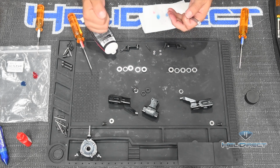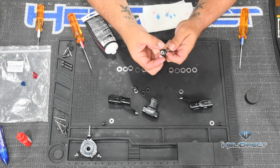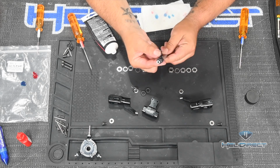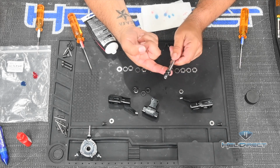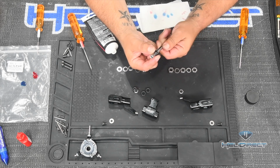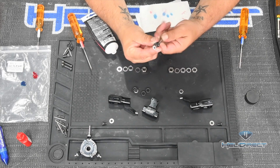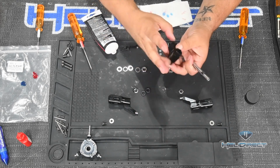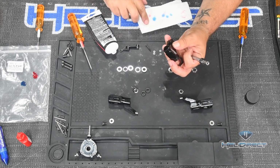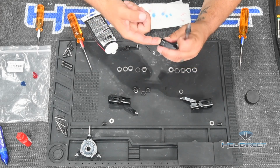And I tend to keep the grease handy, and I put pressure on it with one hand. And then you just put some on the fingertip of the one I'm going to use. And I'm going to grease these now. And you can put a little grease on the shaft that they'll go past here with my finger, and then get some all around the outside of each one. And you see what I've avoided now is getting any grease in the end here of this shaft. Now, as well as that, I'm going to take the main hub here, and that's a little too much, I'm going to wipe some of that off here, and I'm going to run my tip around on the inside, get a little bit of grease inside the hub as well.